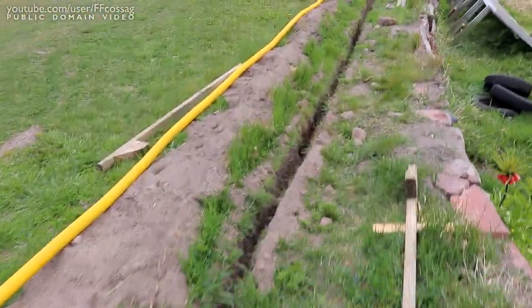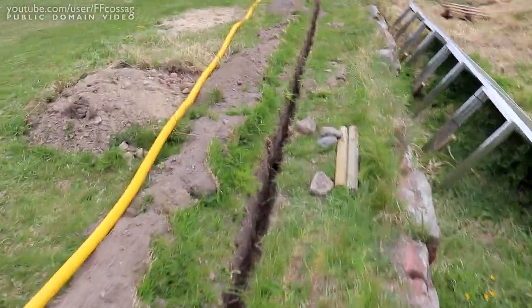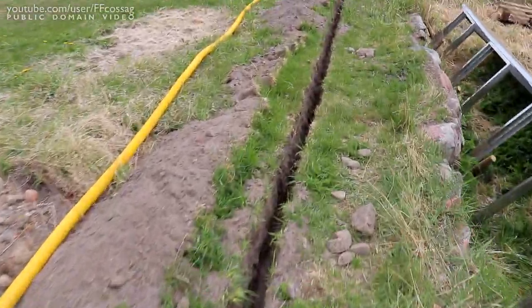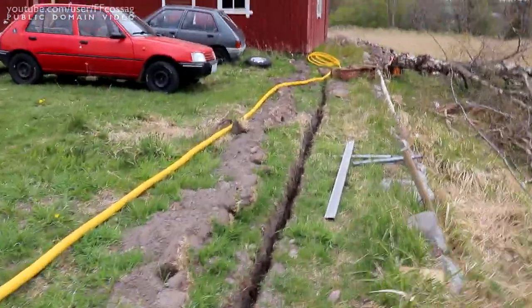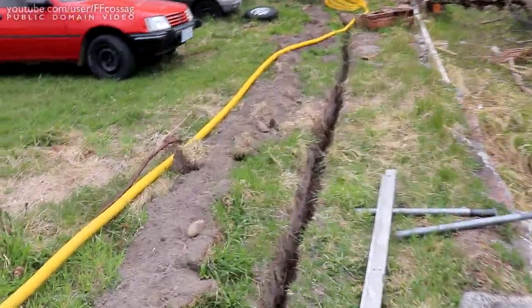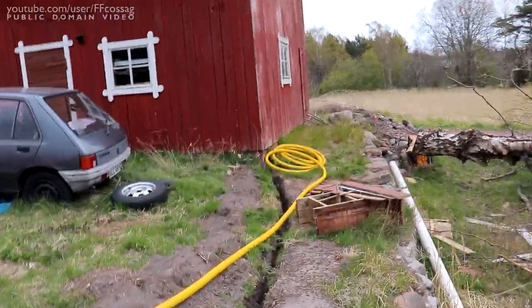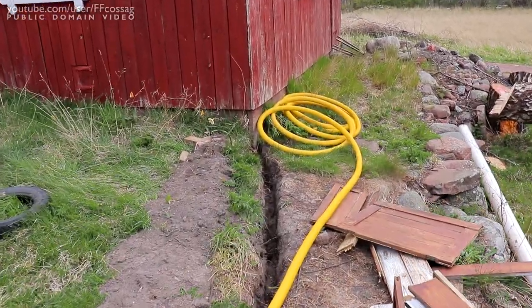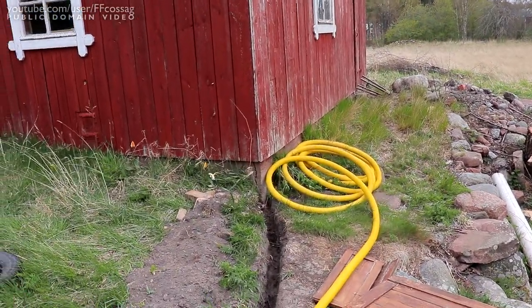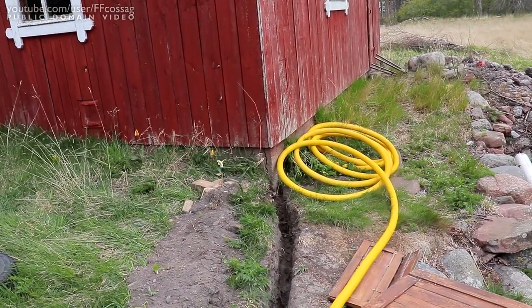So this is my trench that I'm quite proud of. This is completely hand dug from start to finish, about 35 centimeters deep as per electrical regulations here. And this is going to be carrying the pipe with quite a few wires inside. I'm going to be running at least two DC leads and one 3 times 2.5 square millimeter power lead for the barn,